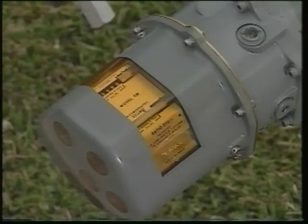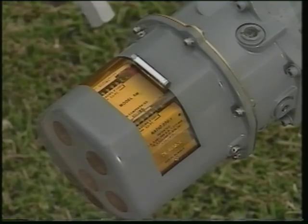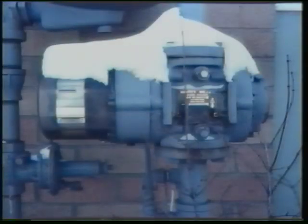Temperature-compensated rotary meters have two counters, one uncorrected readout like the counter unit, and another that displays temperature-corrected readings. Temperature-compensated meters are used where gas temperatures can vary significantly. A 5-degree variance from standard temperature equals a 1% change in volume.